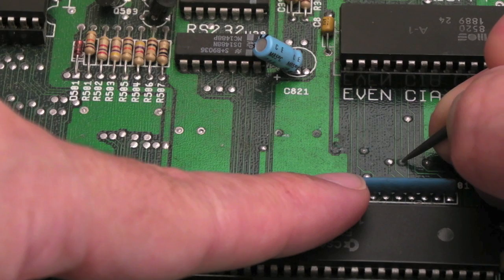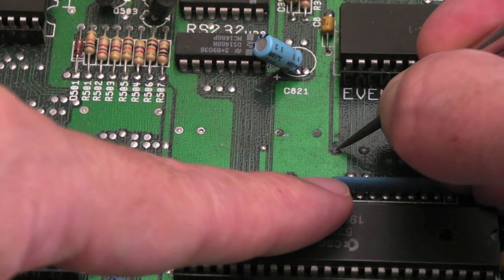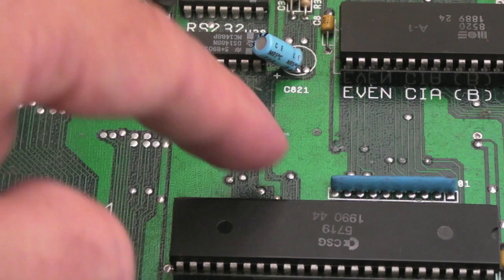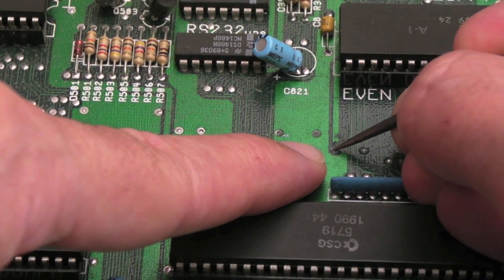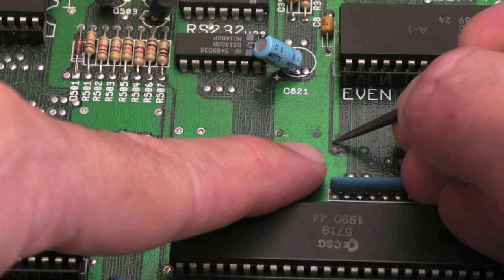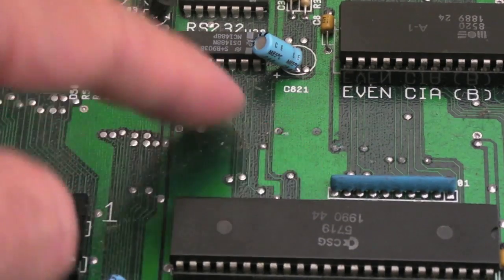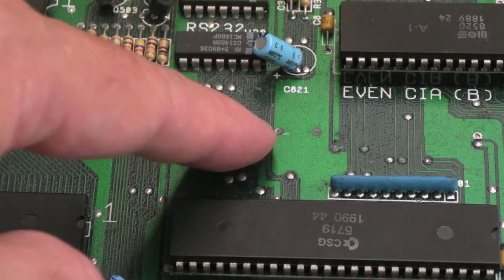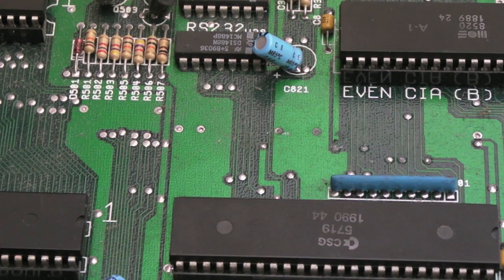I'll clean the vias either by very carefully scratching the surface with a very fine tool - you don't want to break the connections - and then get some flux and solder and just reflow them, or use a fiberglass pen. The problem with the fiberglass pen is it affects a wider area. With this tool I can just focus on the tops of those little vias, get them back to a metal surface, remove the corrosion, and then use some flux and solder braid dragged across as you heat it to tin the tops.